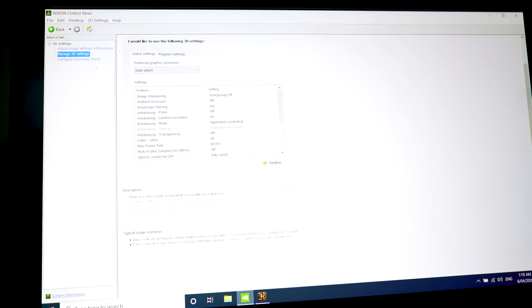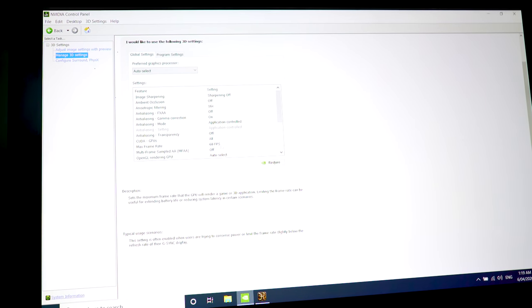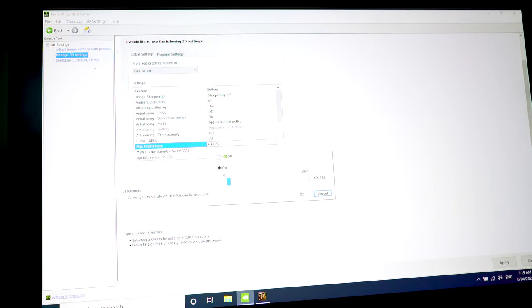And this is the weird thing, I'll show you right now, I can get it to actually work properly. It's a weird fix where I go to the Nvidia control panel and change to integrated graphics, the Intel HD graphics, run the benchmark, close it down, then change it back to auto select, and then I run it and it works after that.